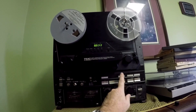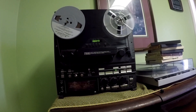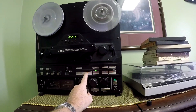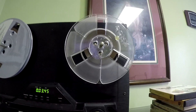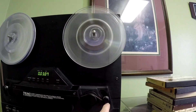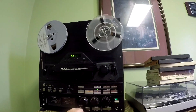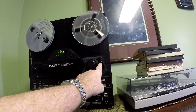Push play and hopefully you'll see these engaged now. So while it plays fine, and if you push fast forward there's no problem there, but stop it and try to push rewind — it doesn't go. If you give it a little help then it goes fine, but if you stop, it slowly comes to a stop again. So everything's working as far as play, plays both directions, fast forward — just no rewind right now.